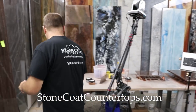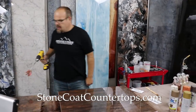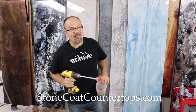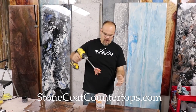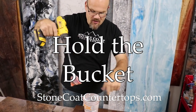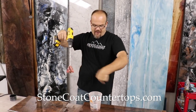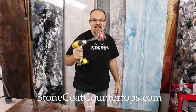This is important — we actually have some funny stories behind this. When you're going to mix the epoxy and you get it full of epoxy, especially in the winter, and if you haven't heated it up enough, it creates a lot more friction because it's thick. So when you go to mix it, make sure you're holding that bucket, especially a small bucket like this. If you get that full and you just start mixing, that's going to grab and whip. I've done that more than once, so be careful on that.